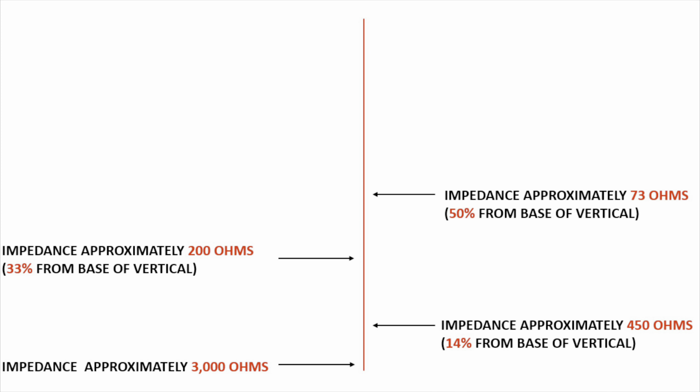As we can see, if we take a half-wave of wire, at different points along that half-wave we've got different feed-point impedances. Right at the very end, for example, we usually have a very high impedance - somewhere in excess of 2,000 ohms. That's when you'd need to use a 49 to 1 or something similar to bring that down to 50 ohms. You could feed your dipole in the middle as you normally would, and that gives an impedance much lower, around 70 ohms - a good match for 50 ohm coax.